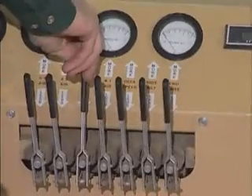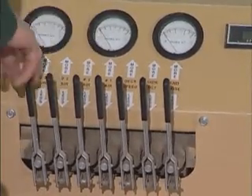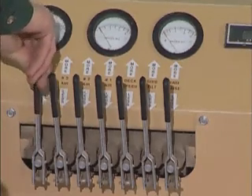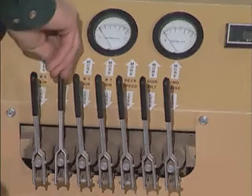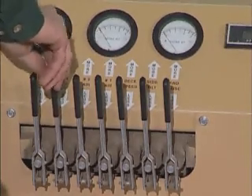After making adjustments to the cut-out gates, go through the air balancing procedure. Always remember that capacity and quality offset one another. Therefore, if the separation quality does not meet standards, lower the capacity of the machine.